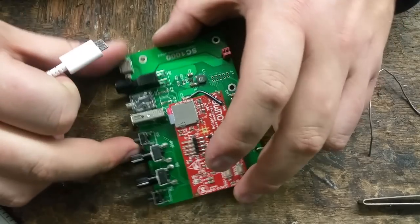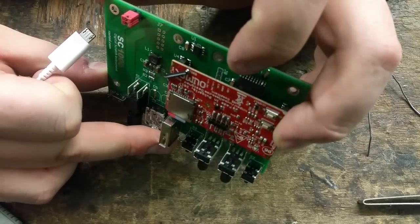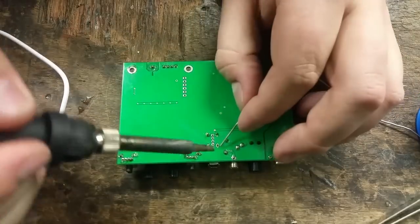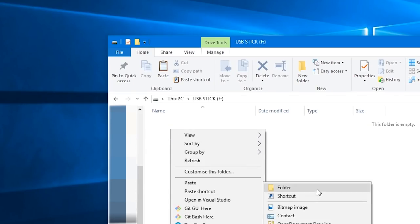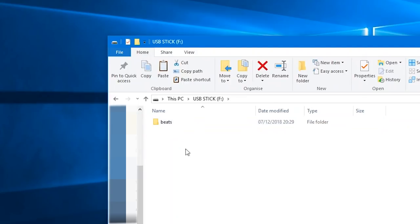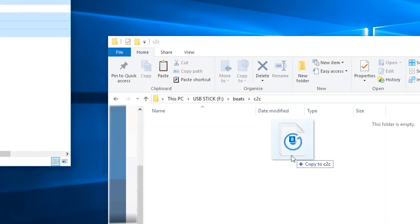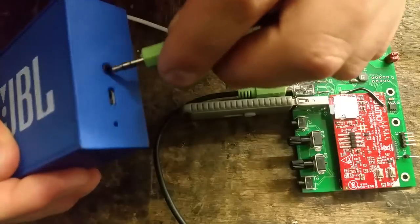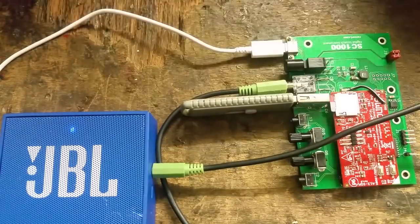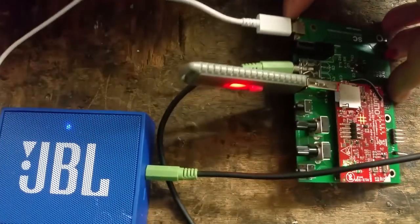This is why we didn't populate the USB connector — as you can see, it would stop you from removing the SD card, and removing the entire main processor from the main PCB is a pain once it's installed. Assuming all is okay though, go ahead and solder in the USB connector. Time to test the audio output. We'll need to copy some audio files to a USB stick. Create two folders, one called 'beats' and one called 'samples' — the names must be all lowercase. Copy any audio files you want to use into subfolders of those folders so you can sort them into albums. Next, connect USB power, the USB stick, and a powered speaker or headphones to the main PCB and turn it on. Once the green light comes on, turn up the Beats volume control, which is the one on the left, and you should hear it playing the first file in the first subfolder of your Beats folder. Success!